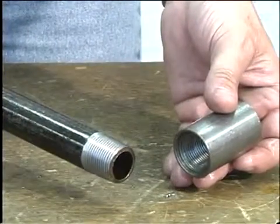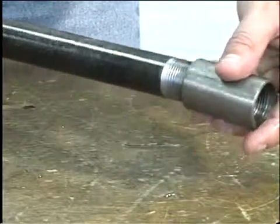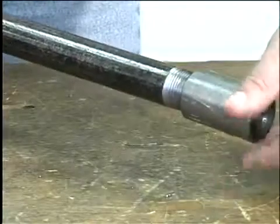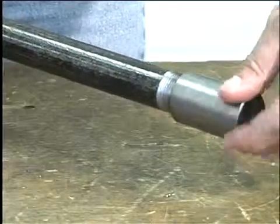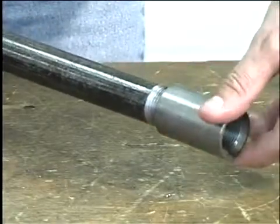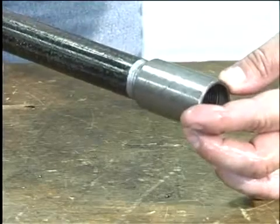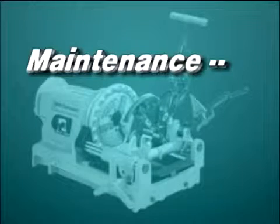If a ring gauge is not available, a fitting can be used. The fitting should be the same as those used on the job. The pipe thread should be cut to obtain 2 to 3 turns hand-tight engagement with the fitting. If the pipe thread is not the proper diameter, the index link should be moved to the over or undersize mark on the size bar.